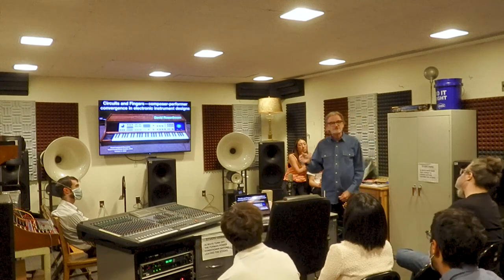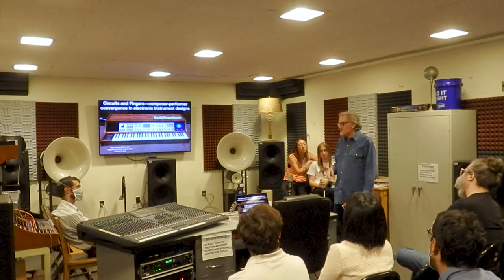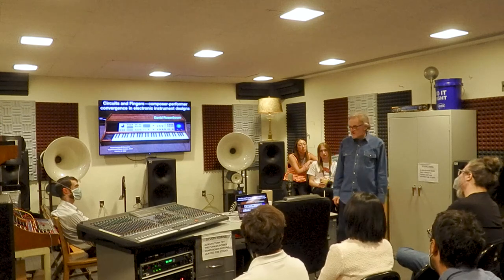So that's it. And then at the center of it, I designed the software for it and chose to use a Texas Instruments 9900 processor, which was one of the first fully orthogonal 16-bit microprocessors. So you had 16-bit registers, and it was great. TI had a drop in the microprocessor business at that moment, and they eventually came up with the 99000, which was a bigger one, and then somehow it just disappeared, and Intel took over. And it ran an operating system that was a derivative of one that ran on the Digital Equipment Corporation PDP-10, which was really pretty powerful. And so I chose to use that.